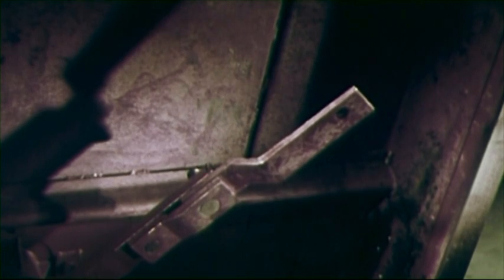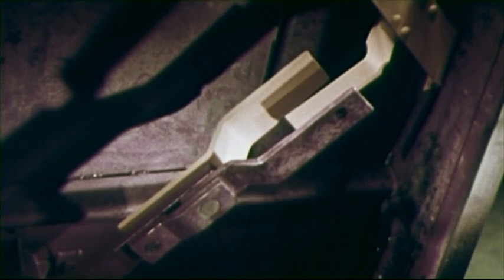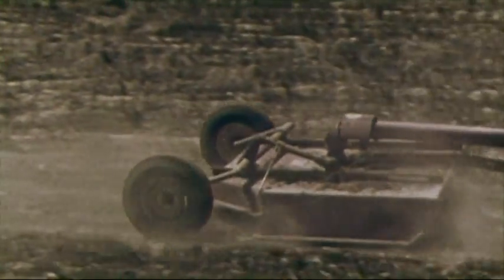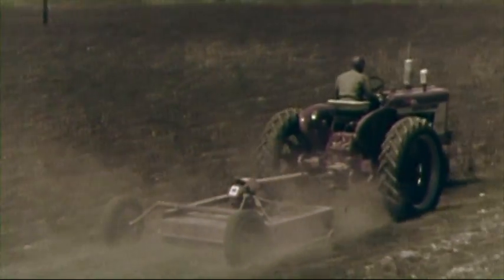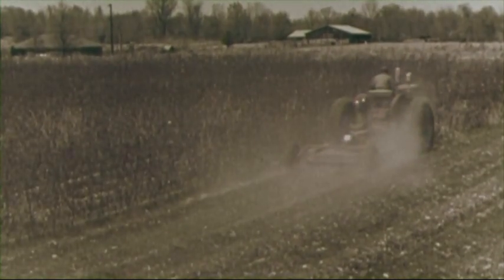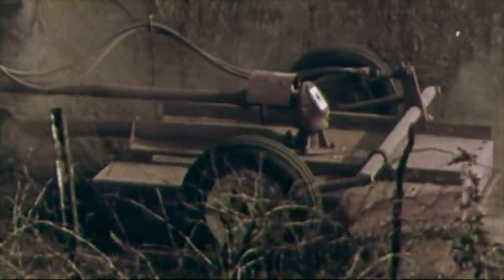If you want really fine shredding, there are models with double knives mounted on the rotor bar, which cut against a stationary knife. By adding a second knife here, shredding can be further intensified. Truly, there is a model for every possible need, and some which can combine many more than one kind of job. The model 310, a 66-inch cutter, is ideal for cotton stalks, yet heavy enough to work in brush, too. The trailing version of the 310 can be equipped either with gauge wheels to the rear or to the side, whichever you prefer.